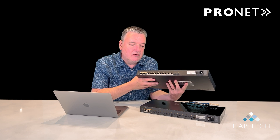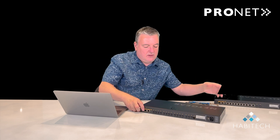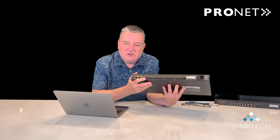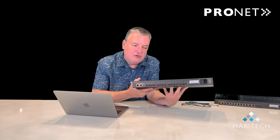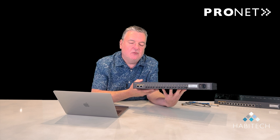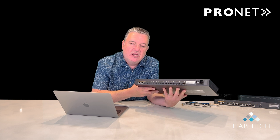When you want to go even bigger, you would use the switch below it, which is this 16-port fiber switch. Each of these 16 ports is SFP+ so it supports 10 gig, and it uses Netgear's IGMP plus technology, which means you don't have to configure any of the IGMP snooping, LAG groups, or VLANs. Everything is automatically configured using very easy-to-use software, which I'll show you in a moment.